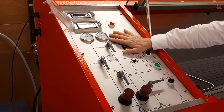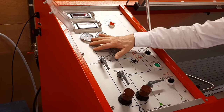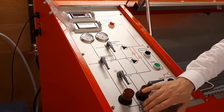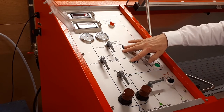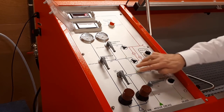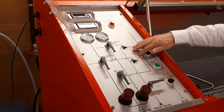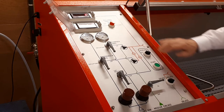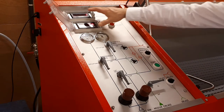When we have a closer view of the panel you see several colored lines. The blue lines are air related — the low pressure pump, high pressure pump, and in the middle the blow-through line. The green lines are all inlet fluid related — the feed line for the pumps and a combined line for the de-air and bleed. The red lines are all high pressure fluid related — the inlet and return for high pressure hose connections and the digital readouts.